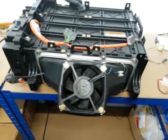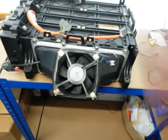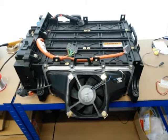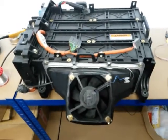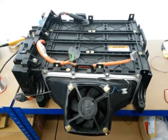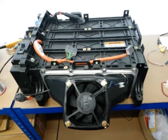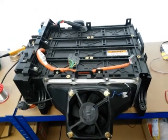Obviously the fan's not running because it's not 30 degrees centigrade in this room. I have tried it with a heat source and it came on at approximately the right temperature. It consumes about 40 milliamps from the high voltage pack at 150 volts. Working that out, it should get about 100 hours of operation for 4 ampere hours of consumed capacity — which is about 4 days.